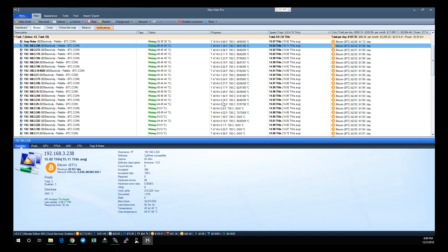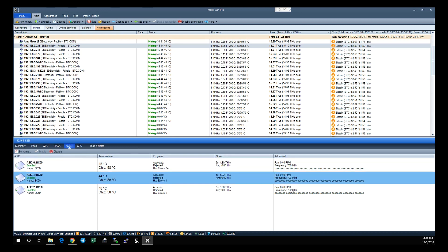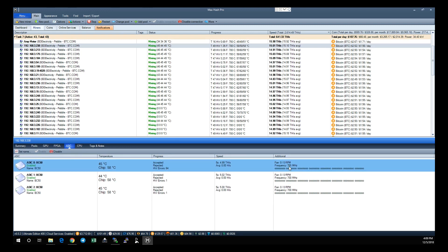Now I'm back at my desk where I can show you the miners' hash rate, the frequency, and the power usage. You can see most of these miners are running between 14.5 and 15 terahashes at 700 frequency, and their temperatures stay roughly between 40 to 45 Celsius. Looking over here at the chips, you can see that there are no fans and they're all hashing at 700 megahertz for about 15 terahashes.